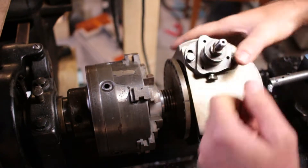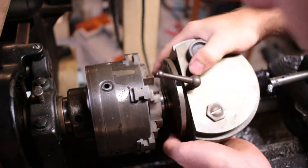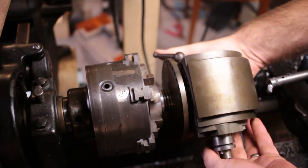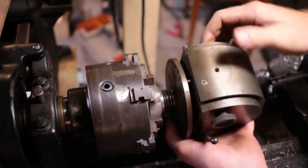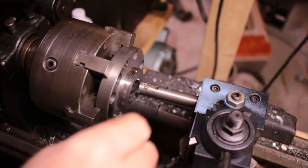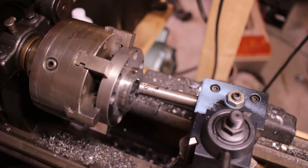Not a lot of wiggle in the threads. I was expecting it not to fit yet, but it seems to work. I'm going to try that with the chuck backing plate, and hopefully the tool I made will cut the cast iron. Now the moment of truth — to see if my homemade threading bit will cut the cast iron. It should; that cast iron is pretty soft, but I don't know for sure.